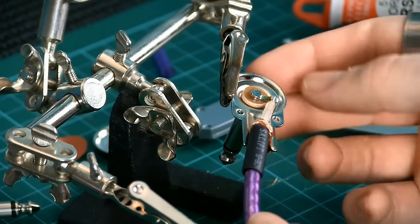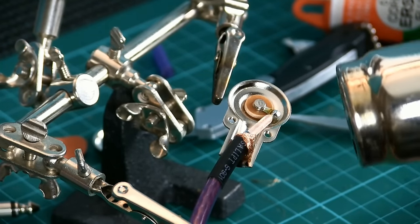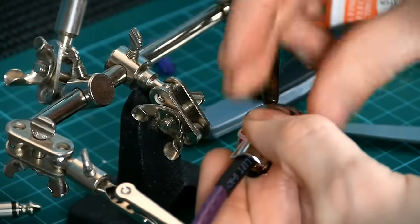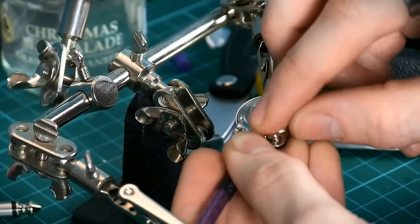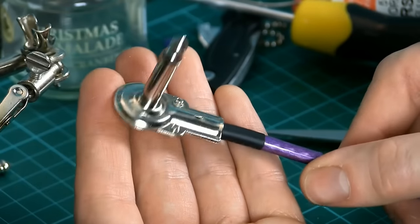For the pancake jack side, we don't need to tin the ground wire. We apply solder to the lug on the pancake jack and carefully melt them into each other, giving one continuous metallic connection. I've wrapped the ground wire around the cable and now slip on some heat shrink tubing to butt up against it. This should assist in keeping everything in place and give the cable some extra girth when we clamp the jack halves together. The insulation disc goes back in its place and we can bring back the top half of the shell and screw it down. This will clamp down tight onto the ground wire making our second connection, and the barb on the interior will punch into the insulation holding it fast.